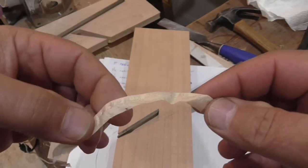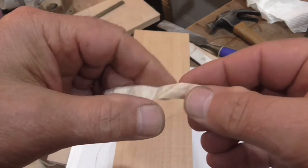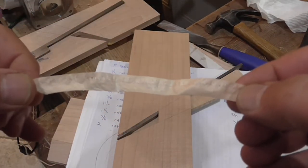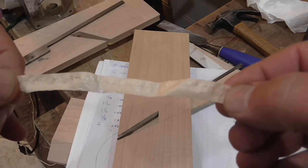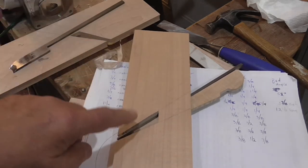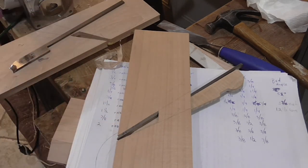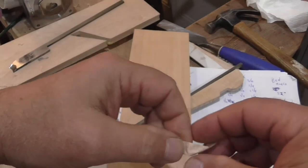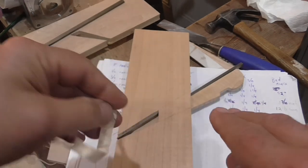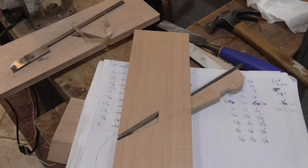As you can see, this doesn't unroll in a straight line, because it's like a one-dimensional shape that came from a two-dimensional cut. So these planes inherently expend more energy to push through more lines of grain in the board and produce this kind of cut, because as the blade is coming through the board, it's doing more work.